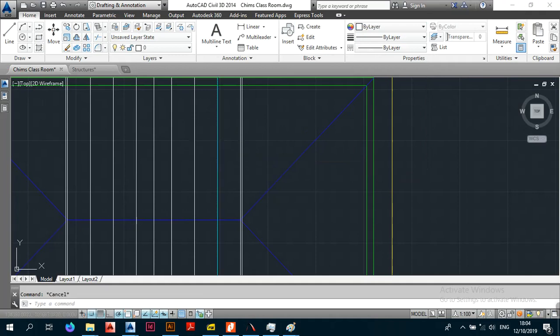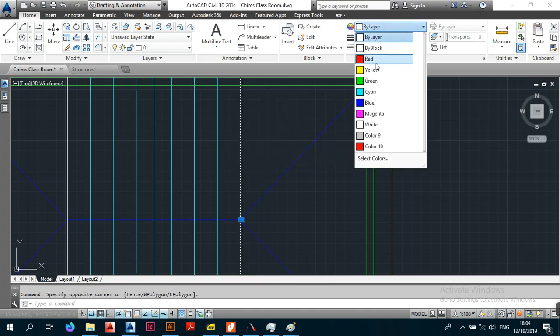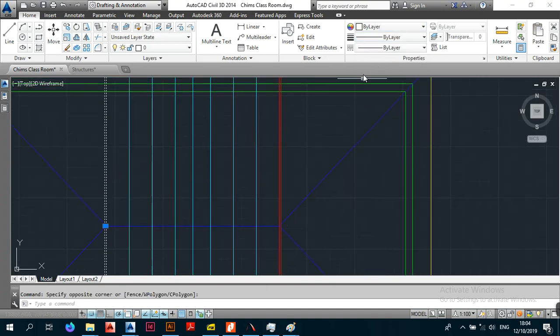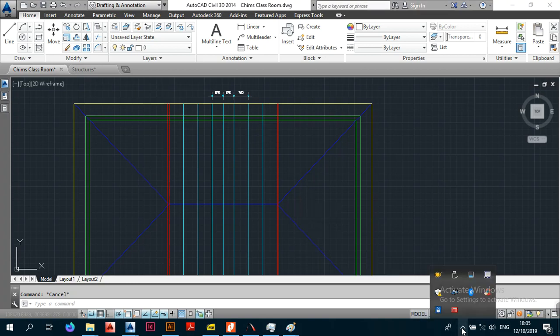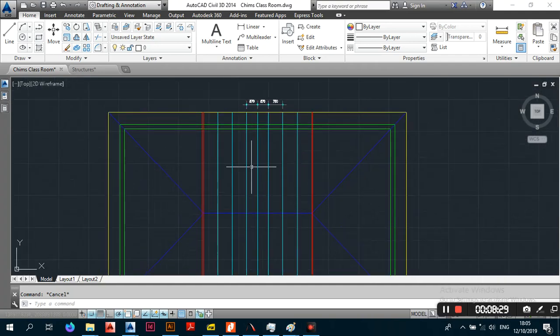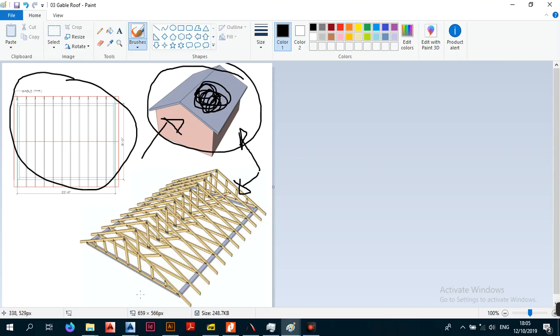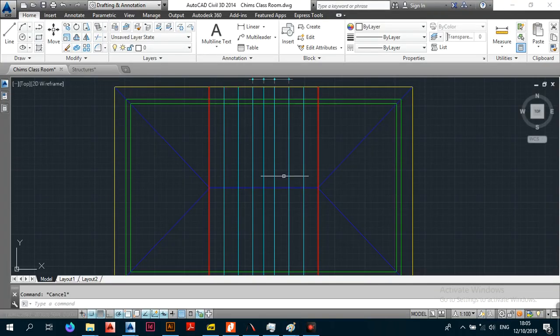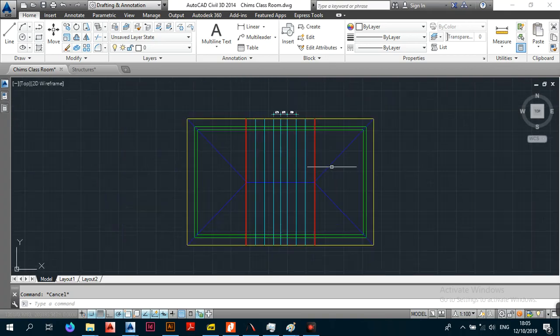I like to have my normal trusses in cyan, but for this one I have it in red. The reason is that at that peak you have a lot of load, so any truss that carries a lot of load I like to highlight in red. Now that you have your trusses laid out, those will be your full trusses — similar to the gable roof trusses in 3D. With the hip roof, the next thing after doing this is to address the walls.